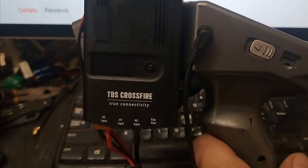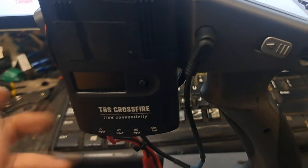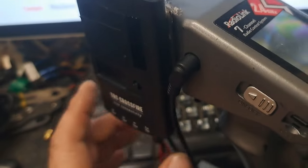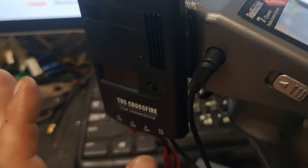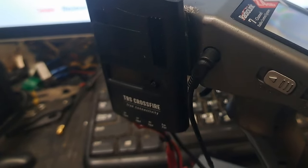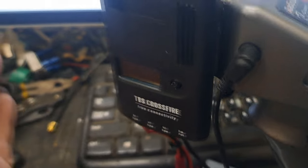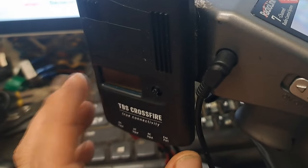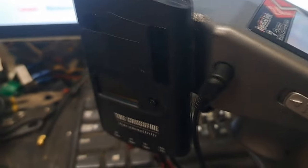That's why I switched to Crossfire instead. Everybody's using ELRS nowadays, but Crossfire is pretty damn good — this module does 2 watts at 915 MHz, which is ridiculous range. It dynamically increases power when it detects signal drop, pushing up to 2 watts if needed, but you probably never actually need it that high. I typically run it at about 500 milliwatts max, and you could probably get by fine at 100 or 250 milliwatts.